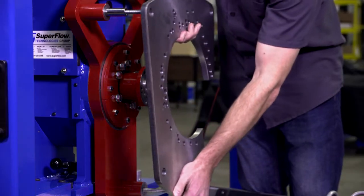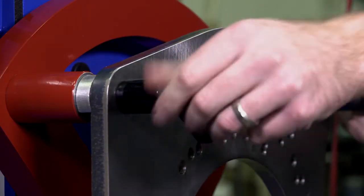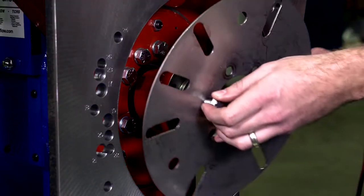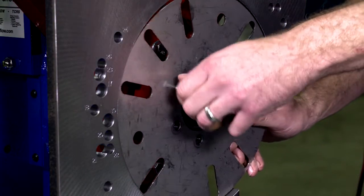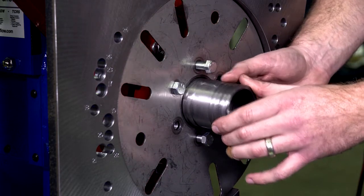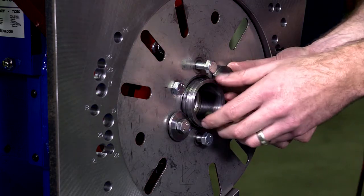Here's how it works. The transmission master plate is bolted to the multi-position turret and the turret is then set to the correct indexing position as indicated on the setup sheet. The flex plate pilots on the flange on the front of the input motor and is held in place with bolts. The master pilot sleeve is installed in the input drive flange and the proper depth is set and held with sleeve latches.